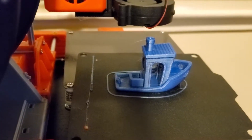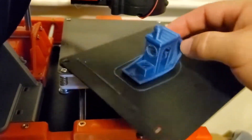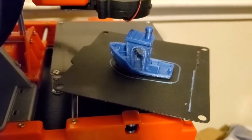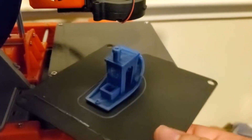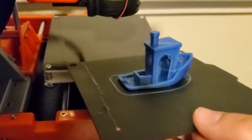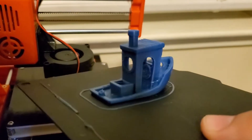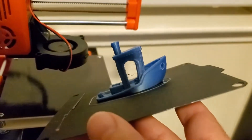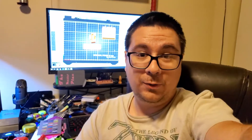There's some stringing, but that might be a temperature or retraction issue. It has 4mm retraction set in the software but doesn't seem to like it that far. This was printed at 205°C. Not bad for a $100 printer — nothing that can't be fixed. Overall that was the Labists EZ3D X1 3D printer: a pretty capable little printer for under $100. Leave your thoughts in the comments below, and as always, like, subscribe, and I'll catch you later.